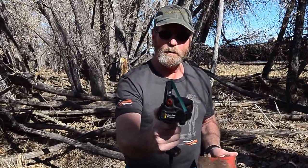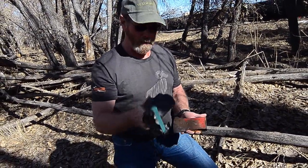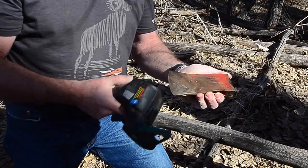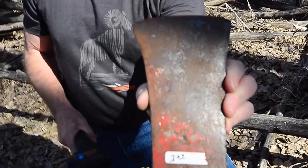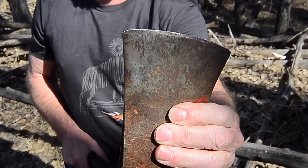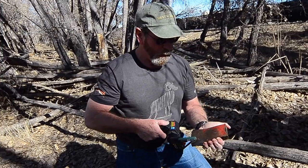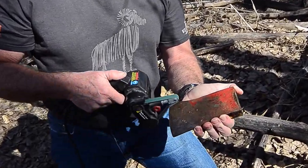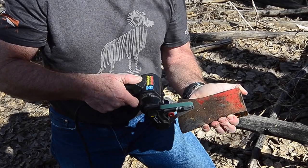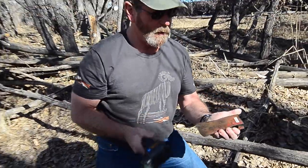The belt is now turning — you can hear the motor. With the guard off, there's a lot more you can do. It's real simple to hold the axe head like this and just run it along. Look at the other side — see how it's all rusty? I only ran it across there twice and see how it's already starting to shine up. I just hold it like this any way I want to and go along, reshaping and sharpening, taking the rough off and some of the rust off.